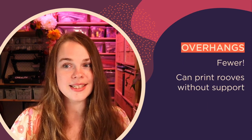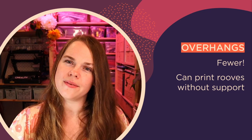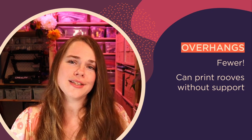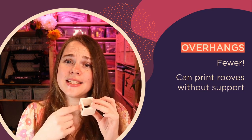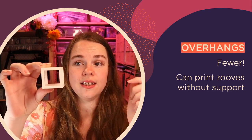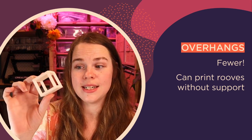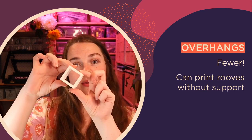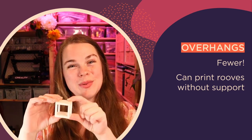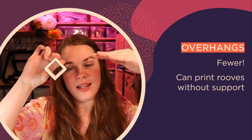While we're talking about this motion system we should also talk about overhangs, because they are quite different on the belt printer. There are fewer of them because the belt is supporting one axis that it normally wouldn't. Because of the direction of the lines you can actually print roofs over spaces without any support. I made a little test object — kind of like a table with two sides — and it was hanging out over nothing with no support, and underneath it's just as smooth as a normal wall. When it was printed, it was printed along in the belt direction, which in normal FDM terms is similar to the nozzle moving in one direction with layers coming up like that.